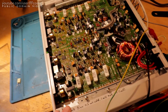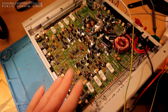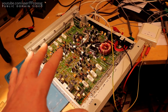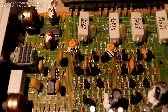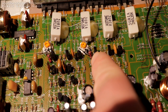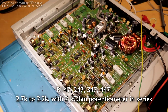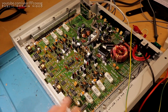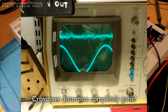One of the main compromises was that it was a fixed bias design — they used fixed resistors to set the bias on each channel. This particular unit had all the bias on one channel and none on the others, so it had a ton of crossover distortion. Thankfully, the design is very simple, so I added a bias adjustment potentiometer. I modified the resistor — originally 2.7K — to 2.2K and added a 2K potentiometer on all channels. It now has a really nice, stable, well-tracking adjustable bias, which completely fixed the crossover distortion.